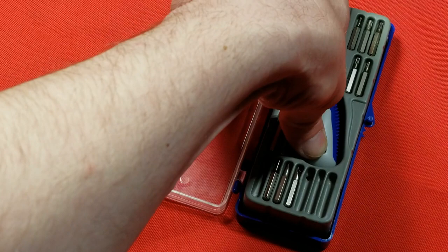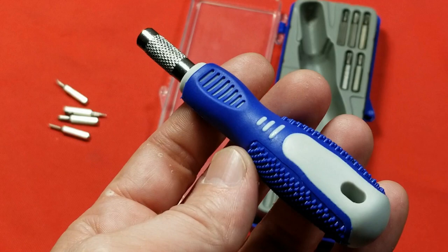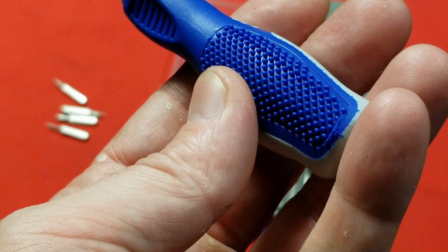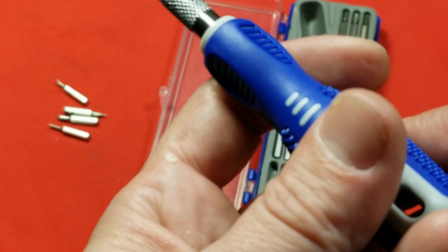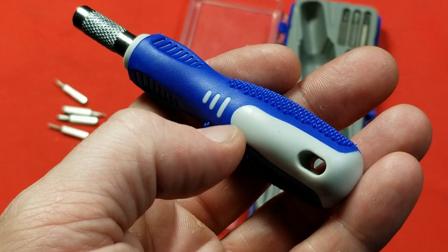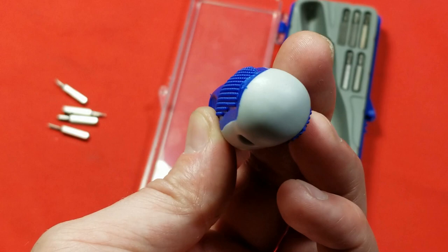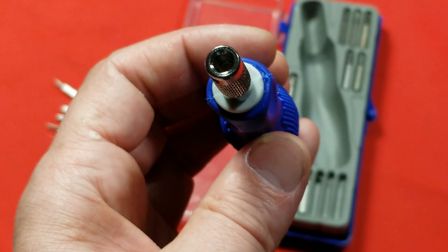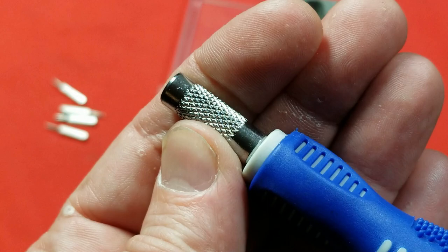As far as the handle, it actually seems to be decent. They have a larger set of these five thirty-seconds bits, but the handle that comes with that set seems kind of cheesy sitting on the shelf. I like this handle because it has interesting ergonomics — it uses a little nub texturing on the back. These nubs work well, but if you really use these drivers or let them beat around the toolbox, the nubs always end up getting ground off, though it still leaves a texture to grip. It's pretty decent quality overmolding, which is a more expensive process. The front is an oval or slightly triangular shape, trilobular at the front, with little finger rests and vertical serrations or jimping to grip. And the very front is also knurled so you can get a pretty decent grip.